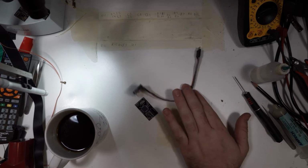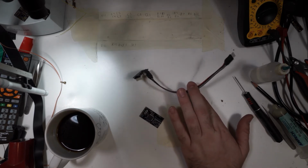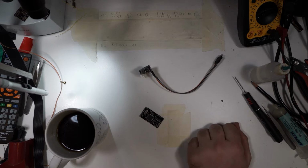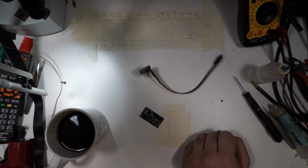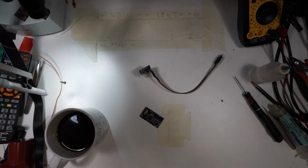This is for that. This FTDI chip is built to do JTAG, SWD, all kinds of different programming protocols. So it's really perfect. So that's what I would recommend doing. There are a couple other FTDI breakout boards that will work for this, but I just went with the FT232 because it's cheap, it's readily available, and it works really well. So I hope that kind of clears up how you do this. It's really not that hard to do, especially if you have the correct programming tools available.